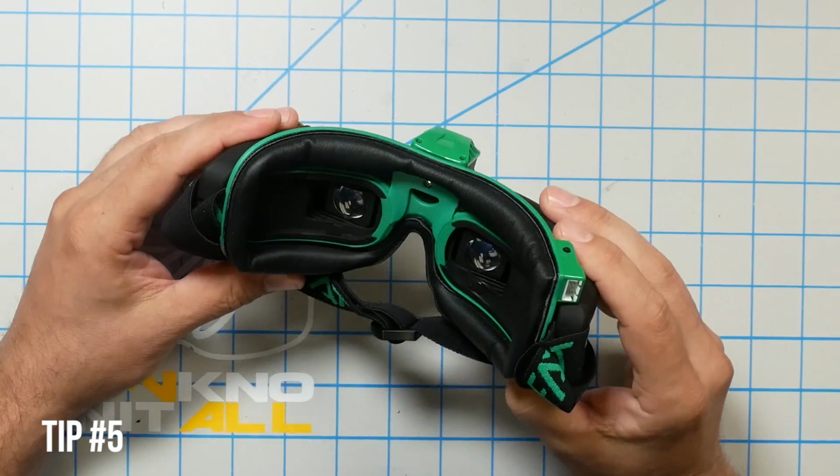You want to double check this because sometimes it doesn't auto start, but it's much better than nothing. If your FPV goggles have lenses, like these Fat Sharks, Aomway Commander, SkyZone, all of them are the same, and the sun shines into them, it will burn the screens. You'll get these white spots on the screen, and that is impossible to repair. You just have to replace the screens.